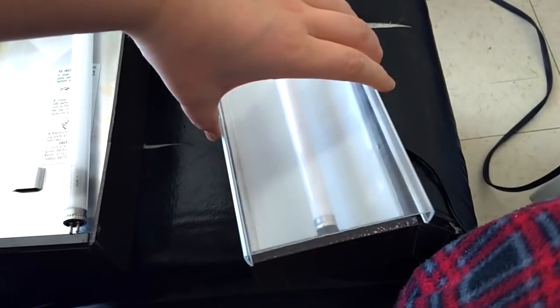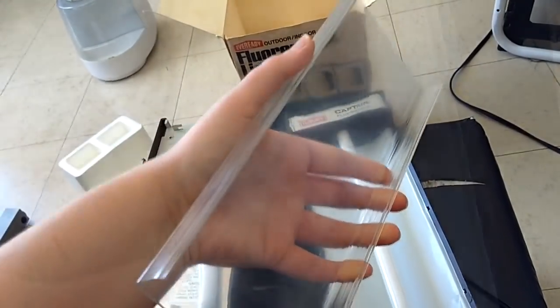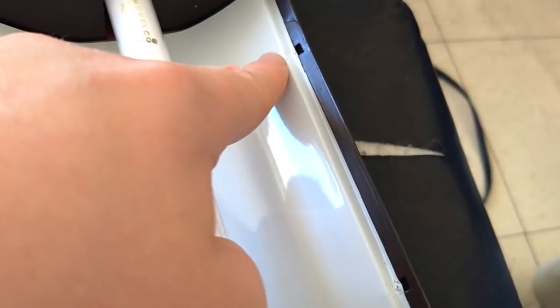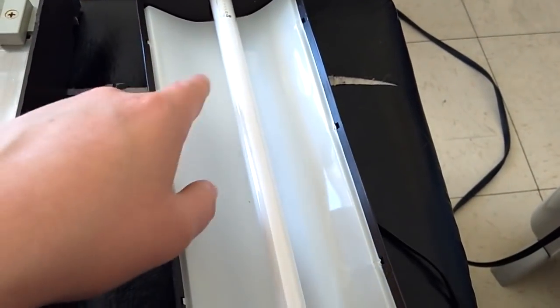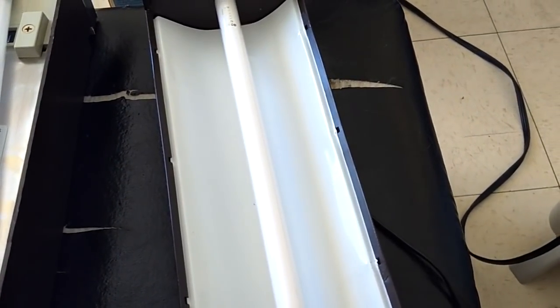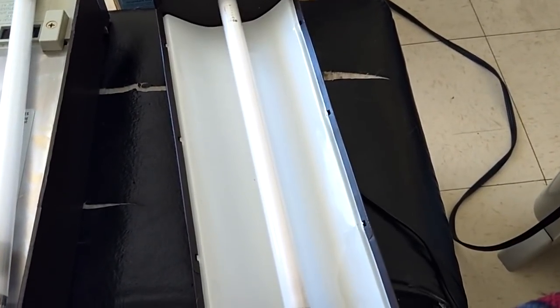So we squeeze the reflector, being careful because it is 40-year-old plastic, and it comes off. Here you can see the white metal reflector, and you might see some bend marks in the reflector. I have removed the reflector. You have to move the reflector to get to the innards, and I've done that so I could take some pictures of what it looks like and study the circuit layout for when I do my DC-DC converter modification. And I'll show you those pictures I took.